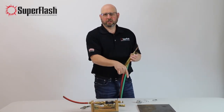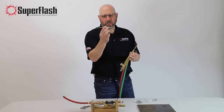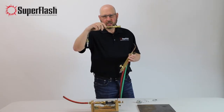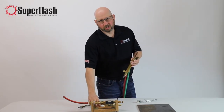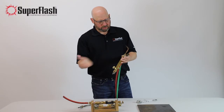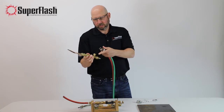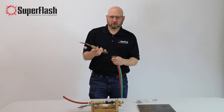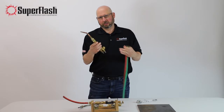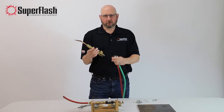We're going to do three little demos here. One is a situation where you just have the workpiece and the torch with no protection — represented simply by this piece. The next piece will be with check valves, and we'll show you what happens when check valves are installed. The last is with a flashback arrester. I've already set my torch. With the quick connectors, I was able to set the torch to a basic mixed fuel gas operation, and I can take the quick connectors off without having to turn the knobs. So I'll use the same mix for all three demonstrations.